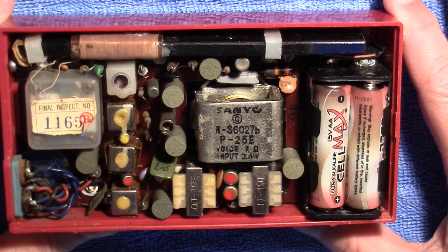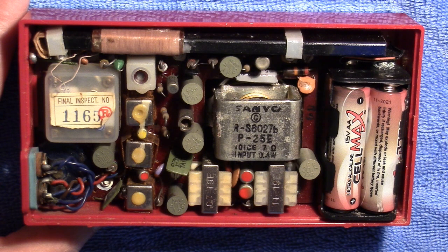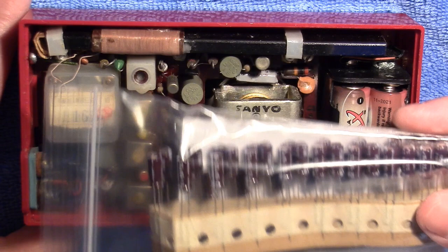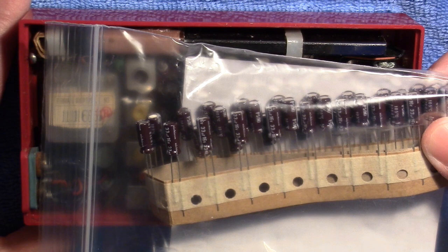In any event, I decided to keep it. I probably paid more for it than I would have if it had been listed as not working or low volume. But it is in good cosmetic shape. So I decided to just get some capacitors — I went on Mouser and got some 33 microfarad capacitors because they don't make thirties anymore. I got some good quality Nichicons from Mouser, so I'm pretty confident they're the real deal.